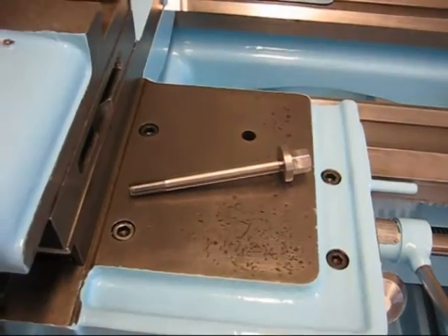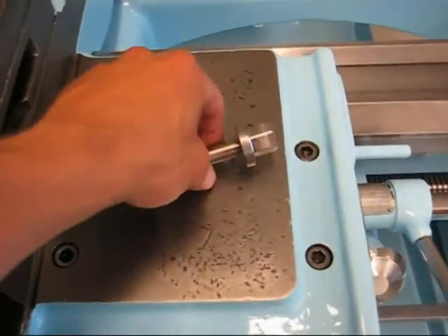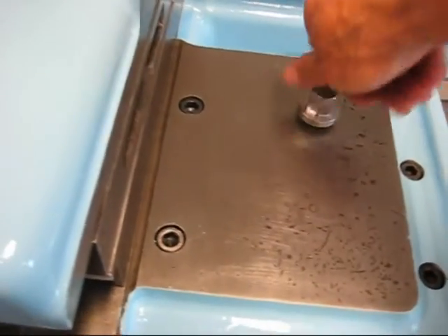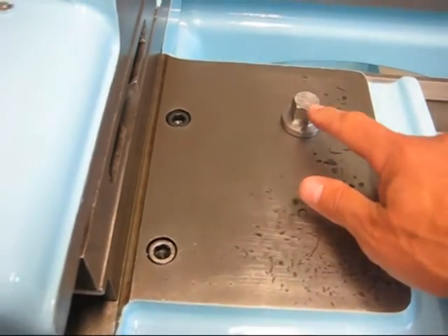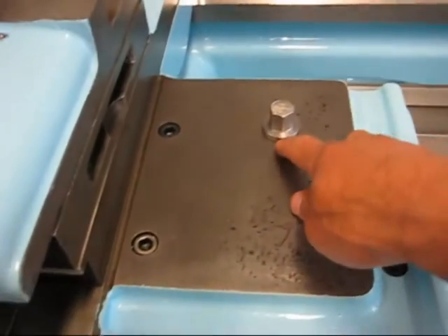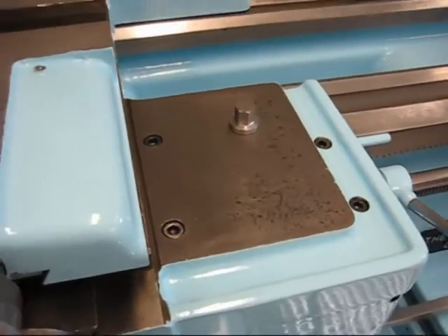Here's yesterday's second project. It's the carriage lock bolt, which I never had before. Yesterday I made it and it works. The only thing I may change is maybe I'll shorten the top bolt head there a little bit, and make a bronze washer for it so it doesn't bite into the carriage itself.